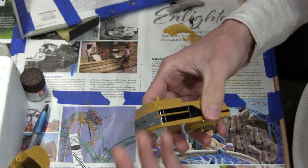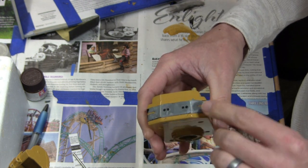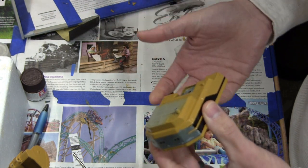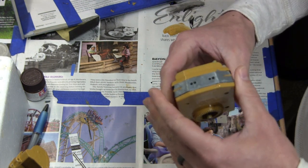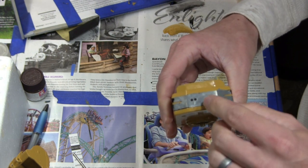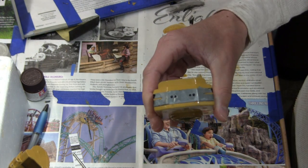So I think what happened was when I painted over this with the black paint, when you paint over paint with other paint, the acetones and thinners that are naturally in the paint soften the paint below and create a chemical bond. That's why they always say to make sure you do your next coats before the paint completely cures. But because I had masked over paint that had just been painted, it loosened it up enough that this bond at the base was so weak that everything just came off.